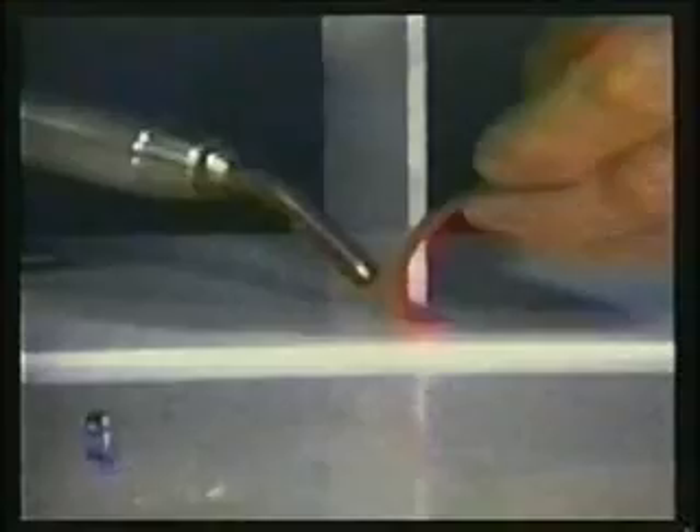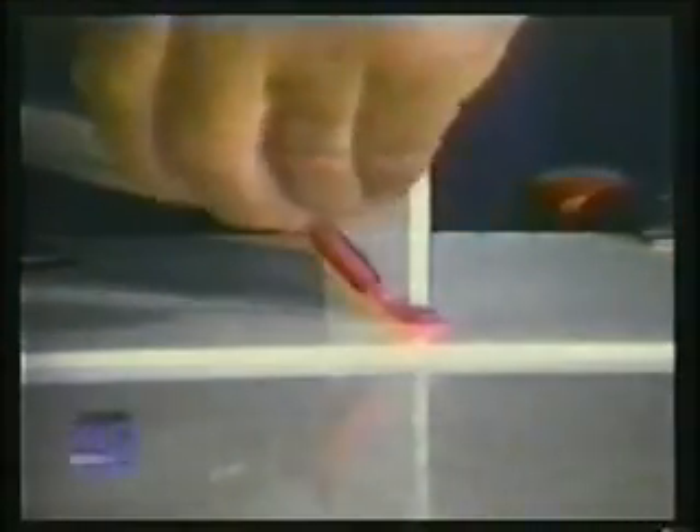When welding an outside corner, some key points to remember are: be sure that your welding rod is at a vertical angle to the weld. Keep a steady fanning motion of heat on the base material and a steady downward pressure on the welding rod, checking for small beads of juicing. If pressure and temperature are correct, a slight juicing on each side of the welding rod should appear. A steady motion around the corner will result in a perfect weld bead.